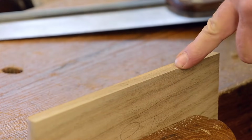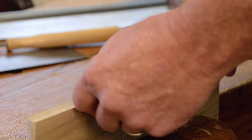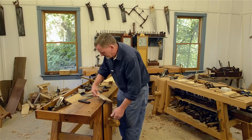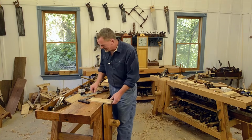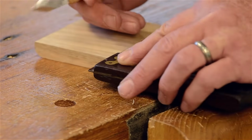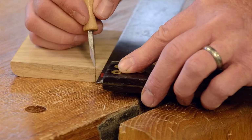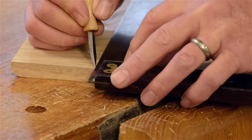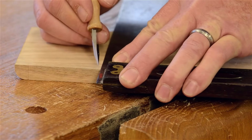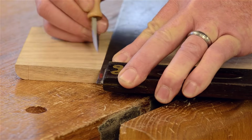So I've knifed either end in. And just before I keep going, I'm going to double check myself. Sometimes I look at something and it looks wrong, and right there, that's the case. Even though it wasn't, maybe I'm getting paranoid. So I'm going to knife these over a little ways here, and the backboard's only 1/2 inch thick like the rest of it, but I'm going to go a little past 1/2 inch.